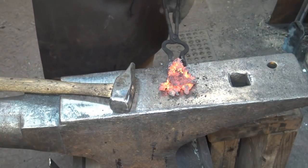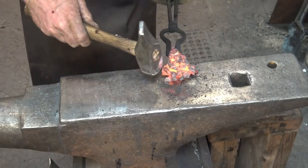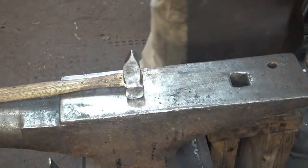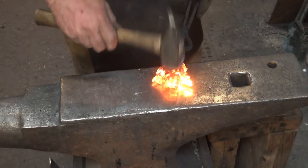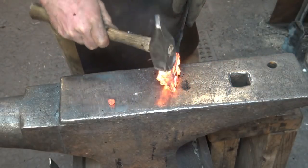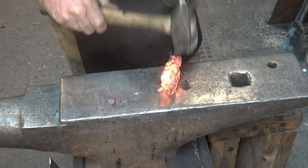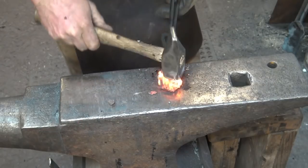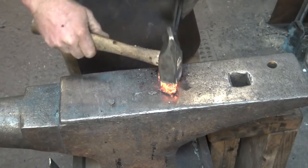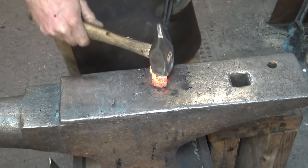It's super fragile — I don't know if you can get it to a welding heat. It just wants to fall apart. I don't know how you make it consolidate at less than a welding heat. This is very much an experiment. I guess I'm going to start with another piece and see if we can get two or three similar sized chunks. I don't know that I would use my efforts here as a how-to guide, because I'm making this up as we go along. One problem I'm noticing is that it's real easy to burn the little rough spots off in the fire before you get to a point that you can start working the bar.